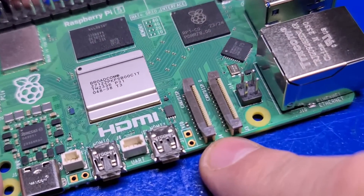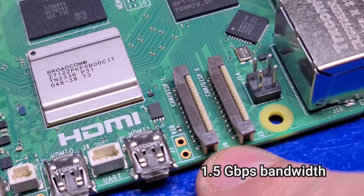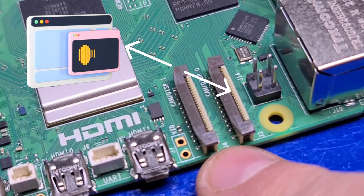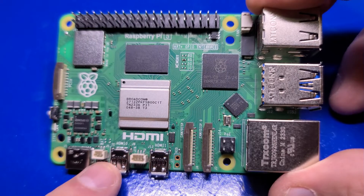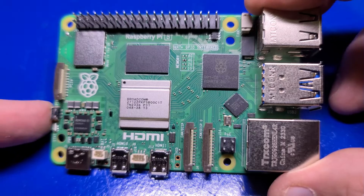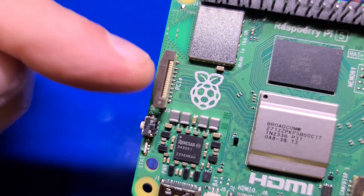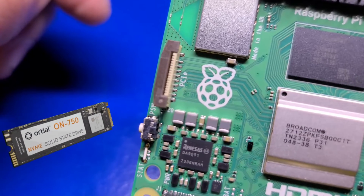There are also two MIPI DSI Display Ports / CSI Camera Ports for connecting additional displays or cameras. Each port supports up to 1.5Gbps and is backwards compatible with older cameras — you can use these ports to add up to two additional displays or cameras with the appropriate ribbon cables. Like the Pi 4, the Pi 5 also includes two micro HDMI ports for connecting two 4K displays, and the USB-C power cable plugs into the far left port. There is also a power button, which is a new addition, and the inclusion of a PCIe port. This port will allow using a ribbon cable to connect a HAT to use with M.2 devices and more, expected to arrive in 2024.